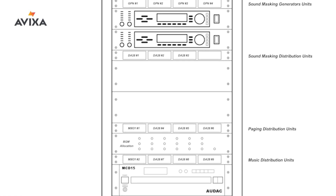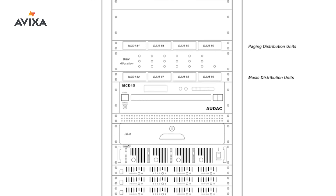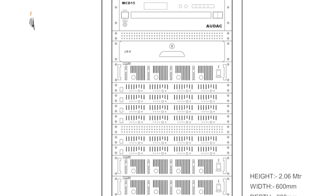Are there any other tips to consider — mistakes you find yourself having to fix over and over, or tips for people starting on their first racks? I always stress pre-planning that rack elevation before you're in the build. So many people are thinking about the rack elevation the day they start the build. I do it in every session I teach — I ask people and they all chuckle, because you get halfway up and what you thought was going to fit doesn't quite fit, and then you strip it all out and start again. Just take the time to plan it. You can use as little as an Excel spreadsheet to work out spacing and build a plan. If you get it wrong, you delete it and build it again — it saves so much time when you actually hit that rack.